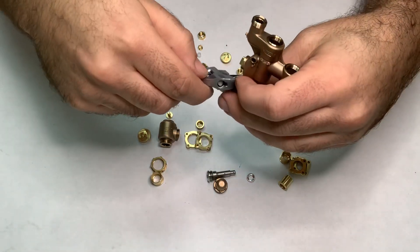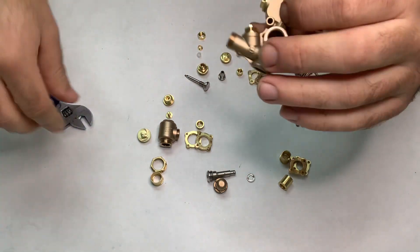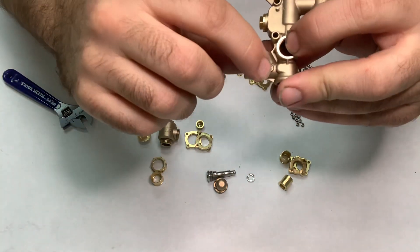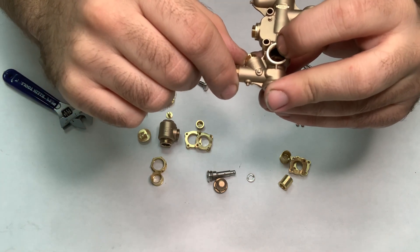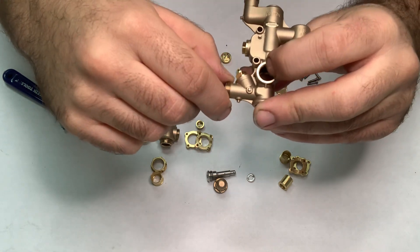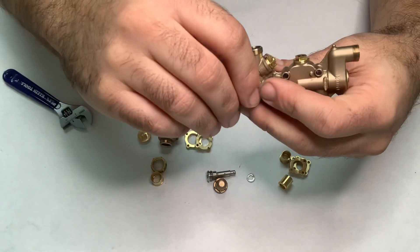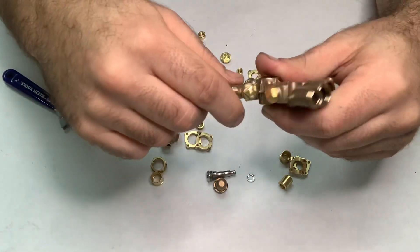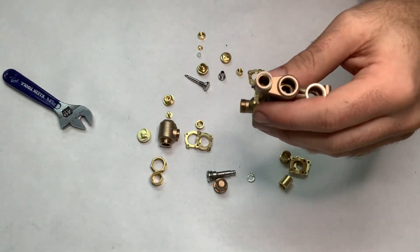This needs to be tight too, because on a handful of injectors the drill would either just slightly break into the core or there'd be little pinhole leaks, so delivery pressure will come into this chamber on some of them — having that tight doesn't hurt. They've all been tested so I know nothing leaks. So let's do the steam cone next.